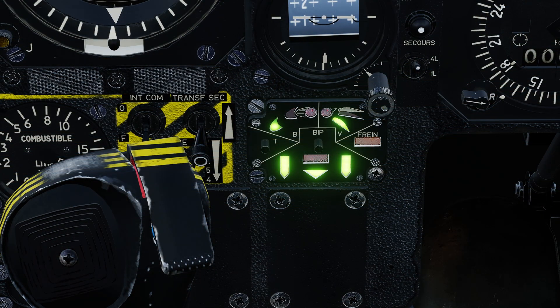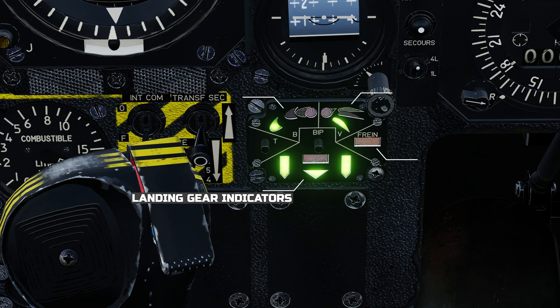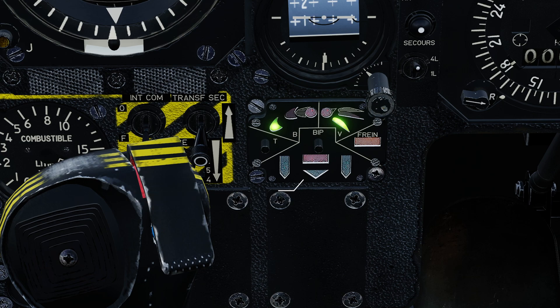The position of the landing gear, slats, and flaps should be monitored on the configuration panel. Gear indicators are at the bottom, slat indicators are at the top left, and flaps at the top right. The three green landing gear lights indicate that the gear are down and locked. When the lever is actuated to retract them, they will extinguish and the red light in the centre will illuminate to indicate the gear are in transit. During transit, the brake light will momentarily illuminate as the landing gear automatically applies brakes to stop the wheels spinning. The red transit light will then extinguish to indicate the gear are retracted and stored correctly. The brake light — labelled FREIN, the French word for brake — will also illuminate when the wheel brakes are applied on the ground or the parking brake is engaged.